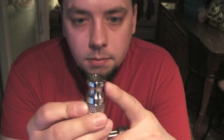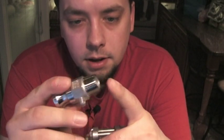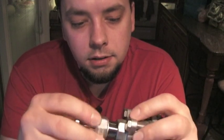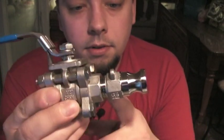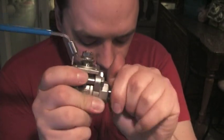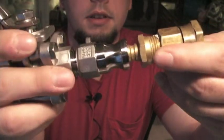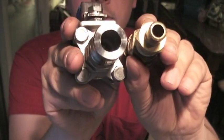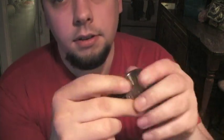There's the male nipple — the male part of the disconnect — and then there's the method it connects to, either a vessel or a hose. This one is a male half-inch male pipe thread, which makes sense if you have a valve on all your vessels — you thread the male in and have this male nipple of the disconnect sticking out. You can see the flow is going to be much better as far as this piece is concerned.